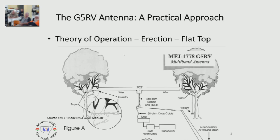But you can certainly do it on that basis, and then you just run the arms down as high as you can get them. But the idea would be, don't panic if they get too low. So it's a good antenna for particularly people who are beginning in the hobby because it's quite forgiving. It's not specific to its location, but it's also good for contesting because it's so easy to switch bands. As soon as 40 metres dies in the afternoon as you're cooking dinner, you just switch it over onto 80 metres, retune the ATU, and then again it runs quite well.